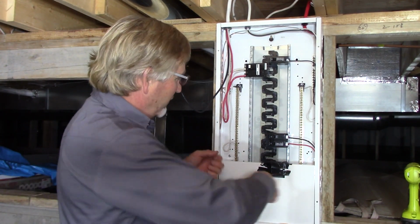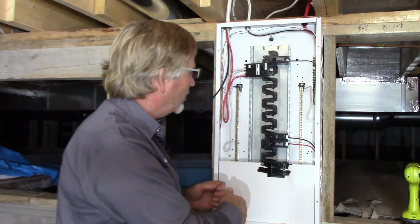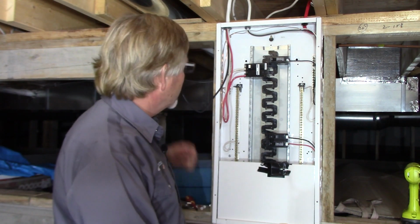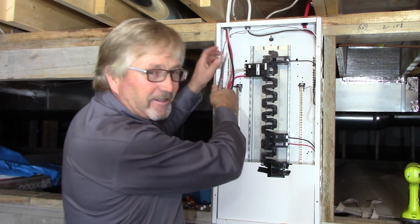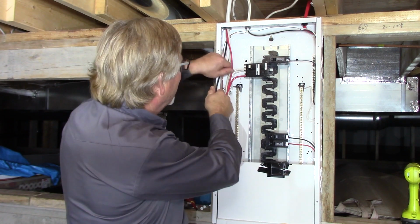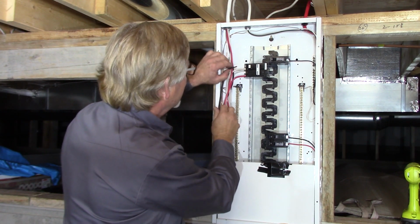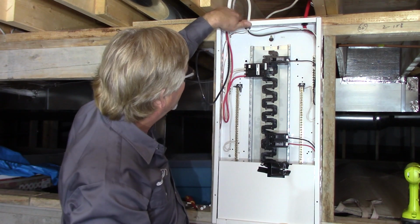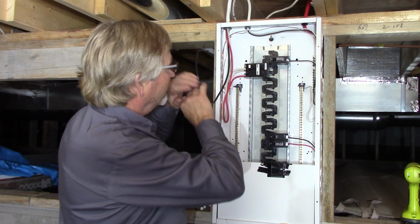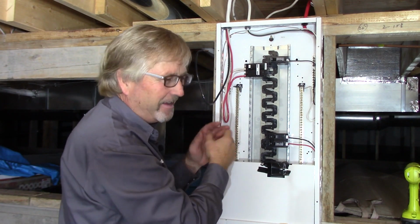electricity is. I had him put a belt around my waist and be behind. I said, if something goes wrong, you gotta pull me back off of there, because I could get locked into those panel buses. And it's true, in the right situation you probably could. But anyhow, so I'm doing that, thinking I'll of course not have any incidents, and I was carefully feeding a new cable in like we did here, and the ground wire got away from me, fell across the bus bars, exploded.